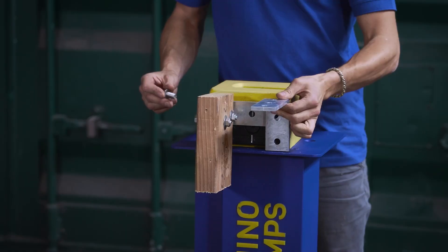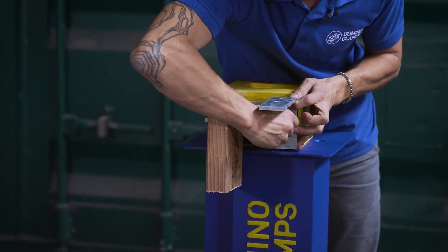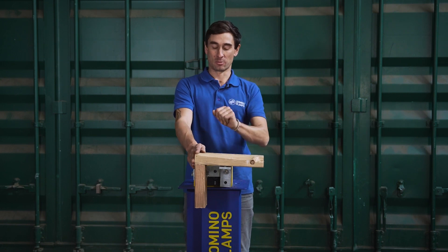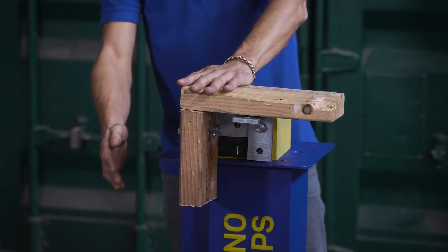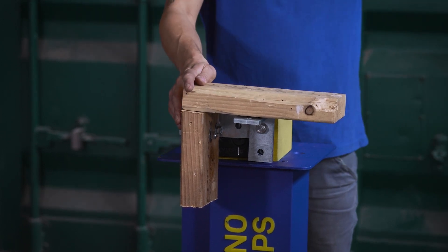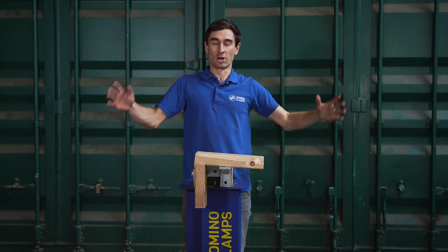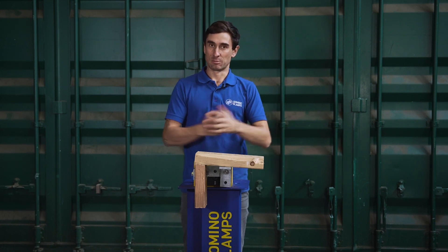What's more, with a second bracket in the other orientation, we can now create a full right angle bracket. We can pop a horizontal timber along there — I do hope you'll do a better job of this than I did, clearly I'm no woodworker — but that's going to present us with a nice strong bracket for our right angle. A similar arrangement mirrored over in the other top left hand corner of the shipping container, bottom left, bottom right, and we've just created a nice rectangular strong frame to start building our cladding and other timber projects.